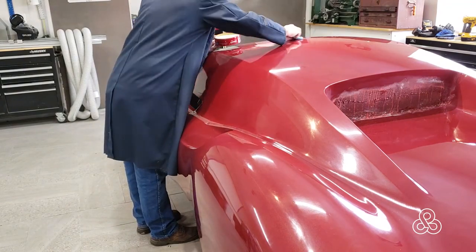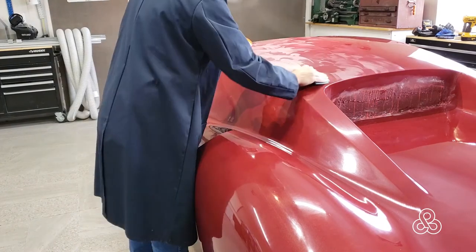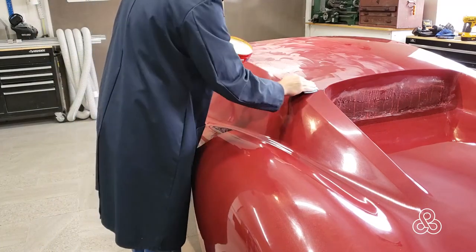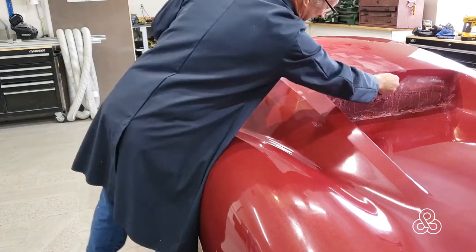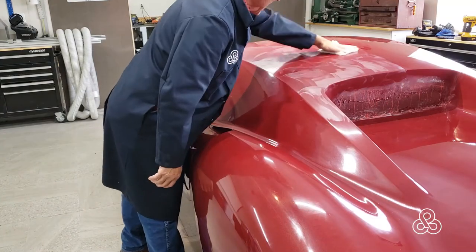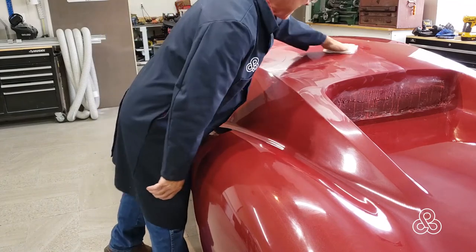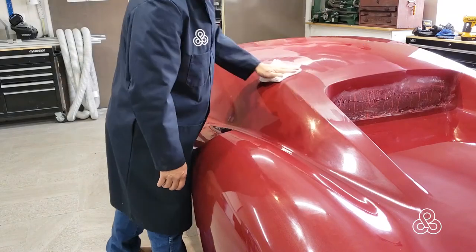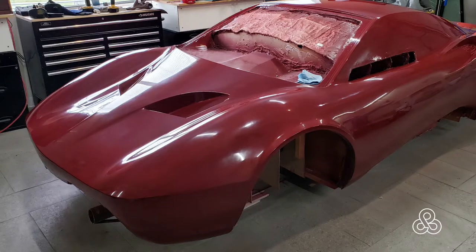A single coat of wax is never enough, and if you had a spot that got missed, the entire mold would bond to your plug and you would be at a loss. So it's always recommended to put three complete coats of wax on — one coat, buff it off; two coats, wipe it off; three coats and you're ready. This wax surface will just be a barrier to make sure that a release happens. We'll also be adding another releasing agent between those two as well, but getting it all coated with wax gets us ready for the final process.